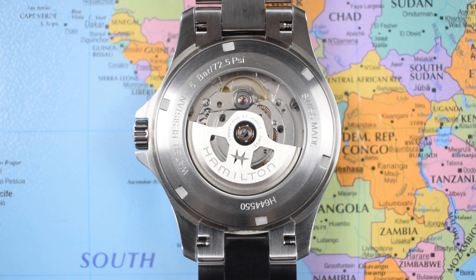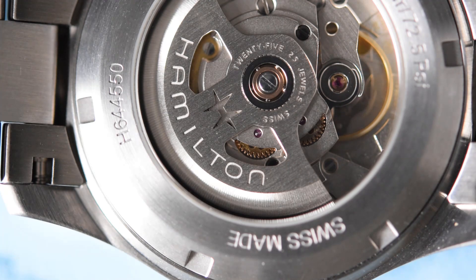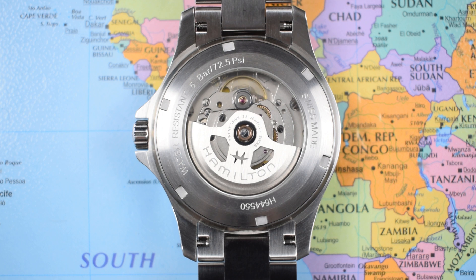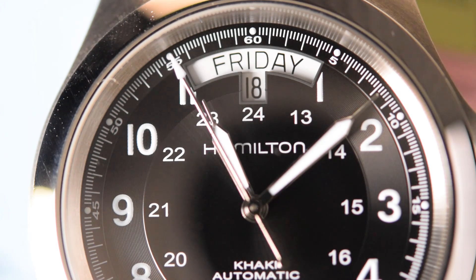So let's pop a link and have a look at the movement. Now these used to come supplied with an ETA 2824 — they still do in a manner of speaking, but not quite. This is what they call a Hamilton H40; you'll find it elsewhere in the Swatch Group as the Powermatic 80 — that's what they call it in Tissot and Certina. It is, in essence, an ETA 2824, but they slow it down from 4 hertz to 3 hertz, so rather than 28,800 vibrations per hour, this one ticks 21,600 times per hour. With a couple of internal tweaks, they've managed to boost the power reserve from 38 hours of the standard 2824 to 80 hours — hence the name Powermatic 80. Really, you're looking at Tudors and Omegas, some top-end Rolexes, Breitlings, and you're still not getting an 80-hour power reserve. And this is a relatively budget watch at $355.